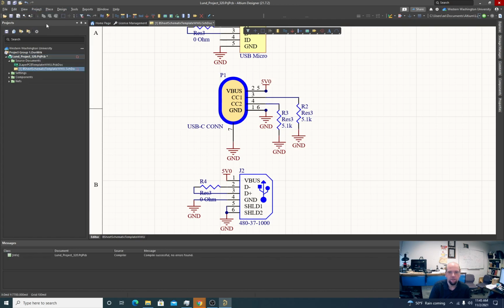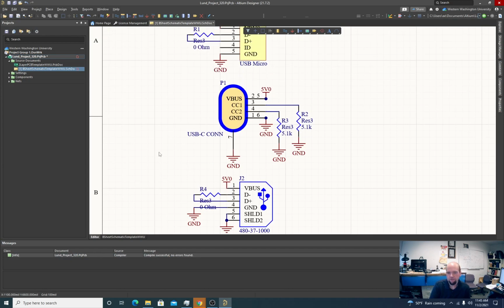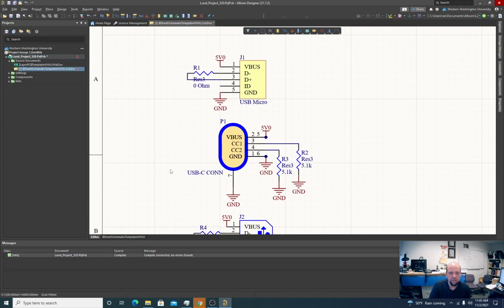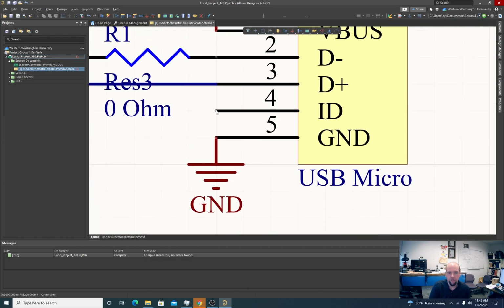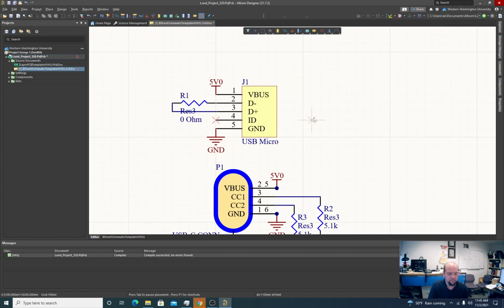What I'm going to do is validate the PCB project. Successful, no errors found. Well, that's good. This is simple enough; you'll get errors later. It's a little strange that it said no errors found, because I left this pin dangling, so normally that would throw an error. I'm not quite sure how that's labeled, but just for practice, if we're trying to specify that yes, we know this pin is not connected and we meant it to be that way, it's usually good to put one of these no DRC or no ERC labels on. We got that, that's good. Let's update our PCB.